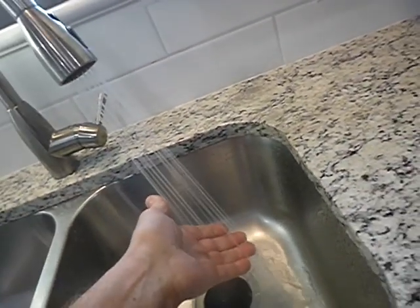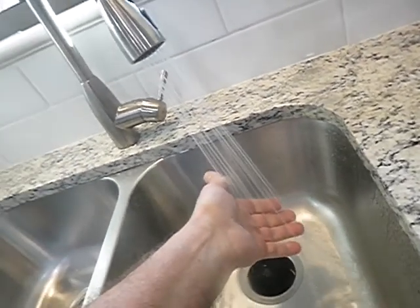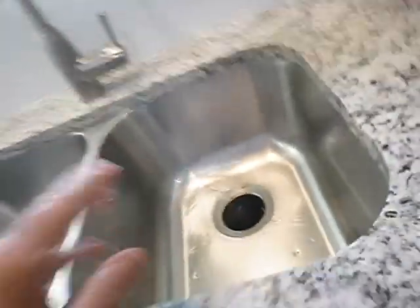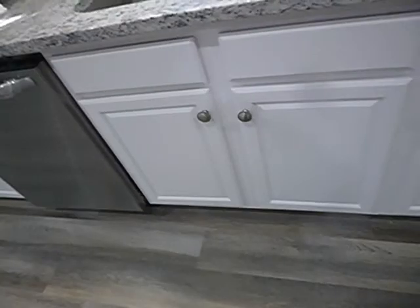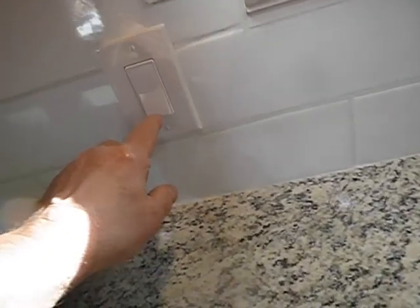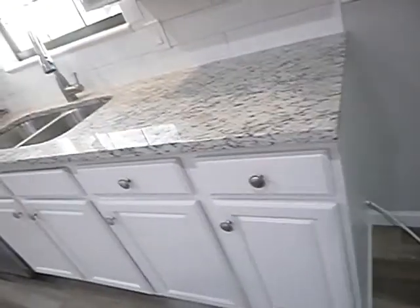Getting some pressure through — we might get some hot water here eventually. Food waste disposal, half horsepower. It does not have GFCI. Also, this is the switch — it's not supposed to be a rocker switch; it's supposed to say 'on' and 'off.' I understand those switches are ugly compared to rockers, but that's what you're supposed to have.